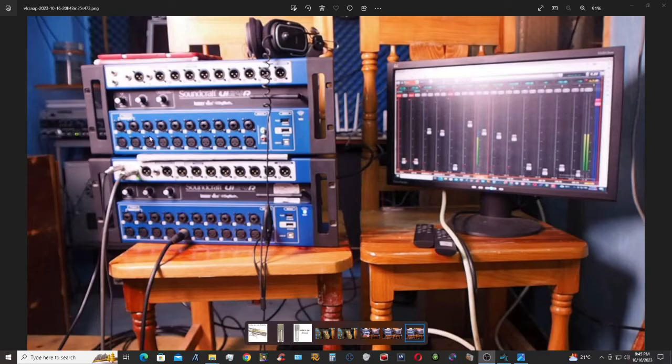And sometimes there's a high-pitched ringing sound coming from the headphone, and it was solved by putting a little jumper wire on F1. So I think that F1 is causing a lot of problems with the CPU board of this ui24r.